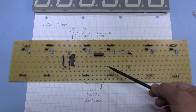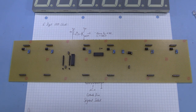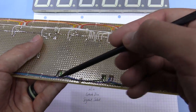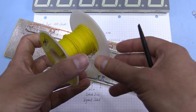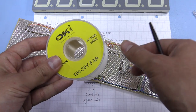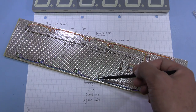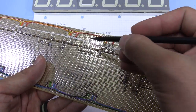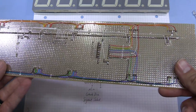I can solder in high-value resistors to limit current to around 20 milliamps while developing code, then once the circuit is running and the watchdog timer is enabled, drop them down to drive the displays at their peak forward current. On the back of the board I've wired everything point-to-point mainly with Kynar wire — really fine wire with either a Teflon or Kynar coating, often used for PCB modifications — just tacked down every so often with hot glue to stop it flapping about.